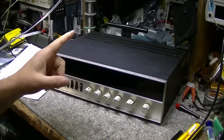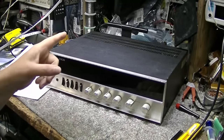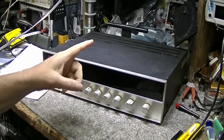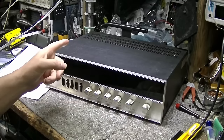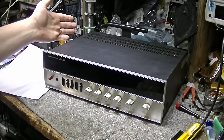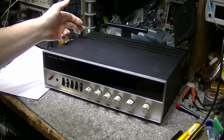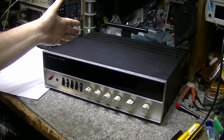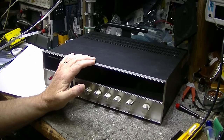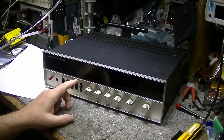I think once I get that sorted, this will sound a lot better. I replaced the power amplifier board in this, and I replaced a lot of the components in the power amplifier. So it's basically got a brand new power amplifier in it. I fixed a lot of the butchered mains wiring, that power coming in. Somebody hacked out the outlet and removed it. So I put that all back and put that back to normal. Added LED retrofit for the function lamps.